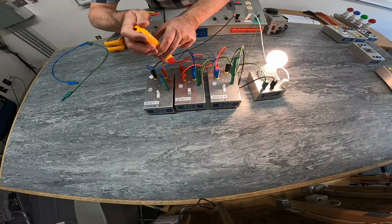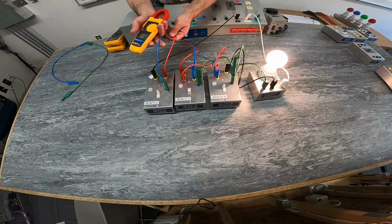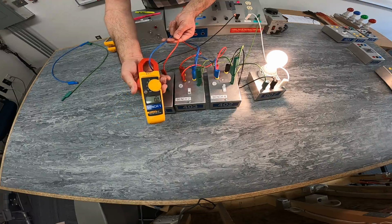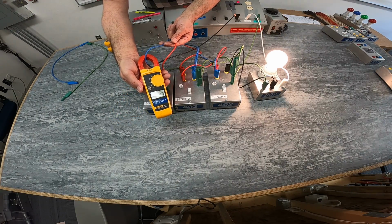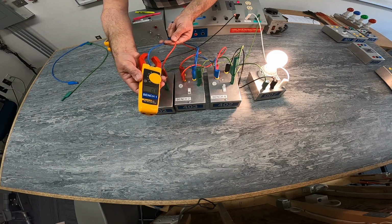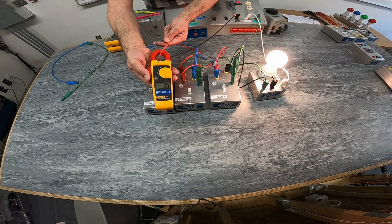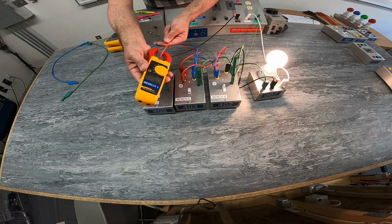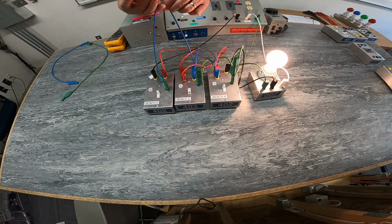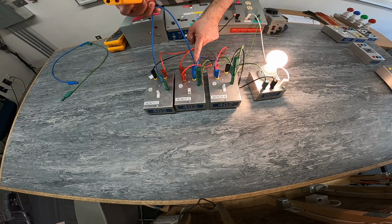All right. Coming out of my three-way switch, I have either a red or a blue wire. We're going to see which one has current on it. Let's check the blue wire. It does. It has 0.3 amps on it. So there is current coming out of our three-way on the blue wire. There is no current on the red wire. Okay. So of these two travelers, my blue one has current on it. It is bringing current from my three-way into my four-way here.